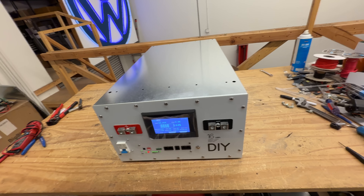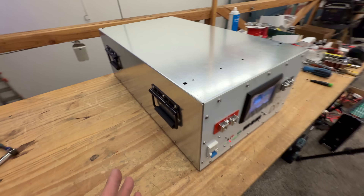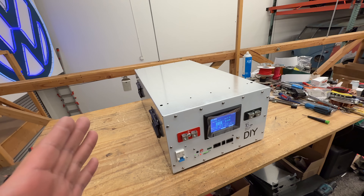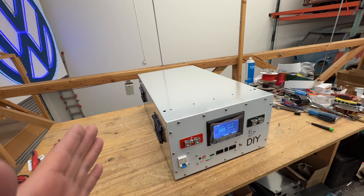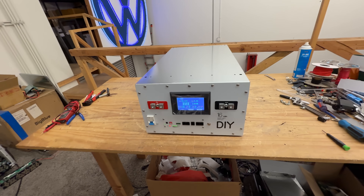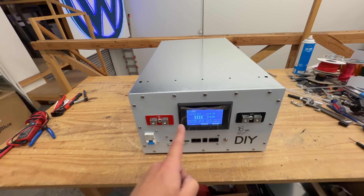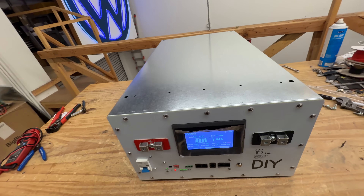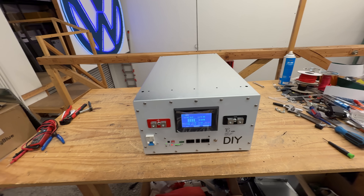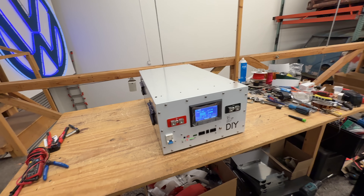This is early in the design process, but now you have your box. With 280 amp-hour cells, this is about 14 to 15 kilowatt hours. With 314s or 320s, you can get 16 to almost 17 kilowatt hours. This is a huge battery that can run your entire home. The BMS is capable of 200 amps — 200 amps at 52 volts is enough to run a whole house. Install it in your garage, connect your inverter, and charge via solar or off-peak grid power.